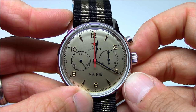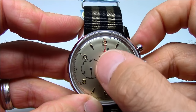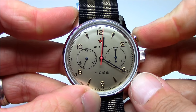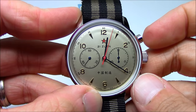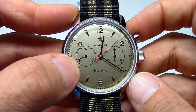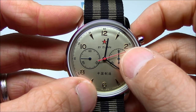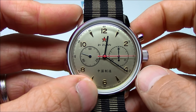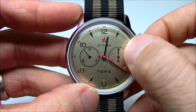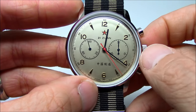It's a very clean design watch. Hours and minutes, of course. Chronograph seconds are indicated by the large red seconds hand. We can start the chronograph by pressing this button at the top, and the hand starts moving. Running seconds are always running, as long as the watch is wound, on the nine o'clock register subdial, and on the far right is the minutes register for the chronograph. After one minute, after this hand gets all the way back to twelve, this hand will index one point. After thirty minutes it will just keep going around, so it's a thirty minute counter.